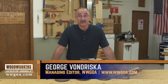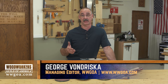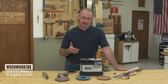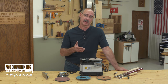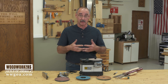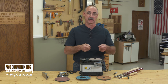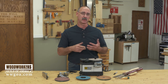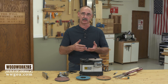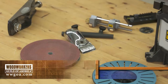One of the lessons I've learned in woodworking is that it's so much more dangerous to use a dull tool than a sharp tool, and your work just doesn't go anywhere near as well. What happens with a dull chisel or a dull plane is that you end up forcing it. One, you're increasing the chance that something bad is going to happen because you're pushing on that tool harder than you should have to. Two, your workmanship is going to suffer because you're not getting the result from that tool that you should get. So really the lesson is you've got to keep your tools nice and sharp.